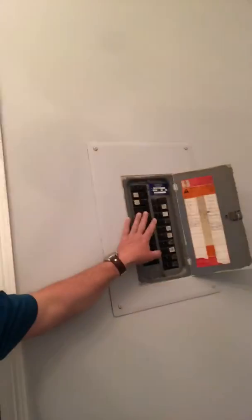Number two, the location of this guy in relationship to that guy and that guy, not good. 6 feet anyway, plus it's just in a bad location being in a bathroom, number one. The floor could get wet, anything. This could be energized. Just a bad place to put it. So somebody opted to use this room to put in another bathroom, and they didn't think about the electrical panel location. Also, you got this guy, the laundry. That's crazy. All right. So, main thing I wanted to do is this ventilation.